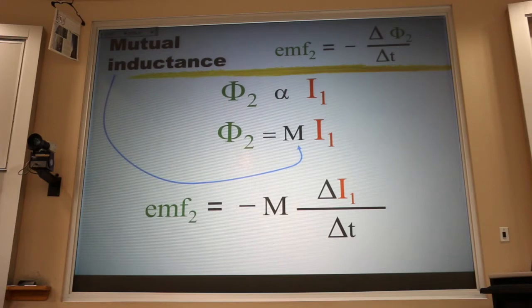Now you don't want tens of thousands of volts near your children or your pets. And so before it gets to your house, we step that down to 120. And we do that with a transformer. It turns out that if you have two coils on an iron donut, and one of the coils has twice the turns, you're going to change the voltage by a factor of 2. The one with the smaller number of turns is going to have half the voltage and twice the current. And so that's how we essentially step voltage up and down.